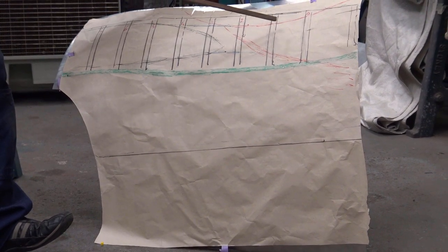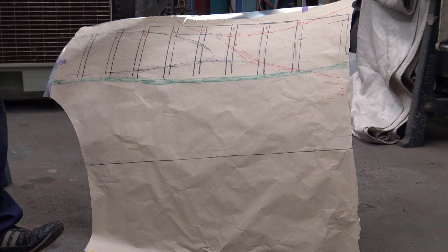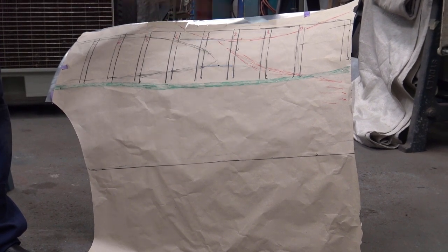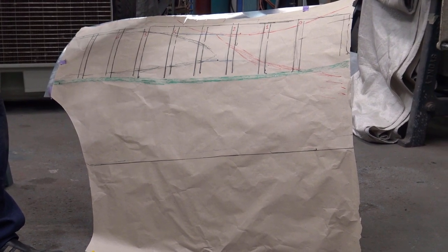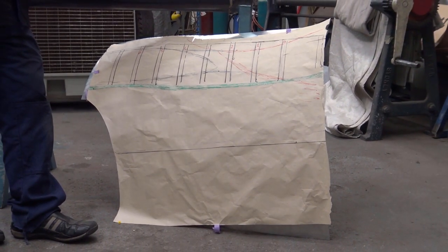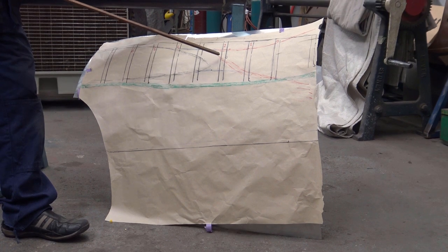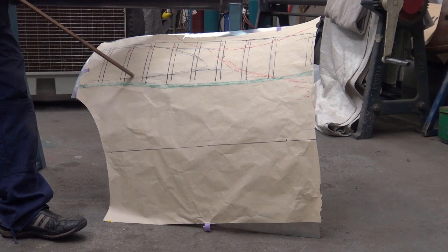Don't forget that when you make a return and you bend it, it comes up. So realistically, if you leave that area alone and start the return, the blend of the return through here, when you bend it over this pipe here, it'll come up and come up flat. I'll say it again, returns, when you bend them, they pop back up. So if you start the return back here, even though it shows here that it's flat, that'll be flat, not bulbous. And then from there, you come along and put your bulbous shape.